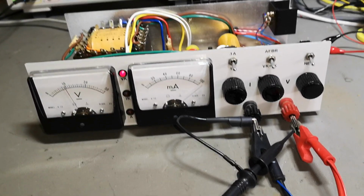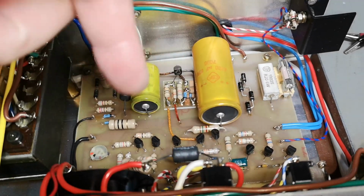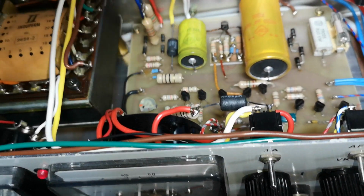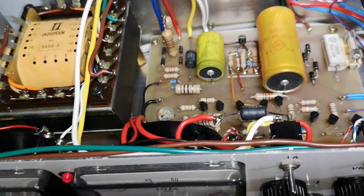That is not bad at all for its age. And also remember, there is no op amp, only transistors, and the gain they provide, and probably this capacitor isn't really that good anymore. I could probably just go and sneak in here and do a little bit of measurements on the capacitors if I wanted to.